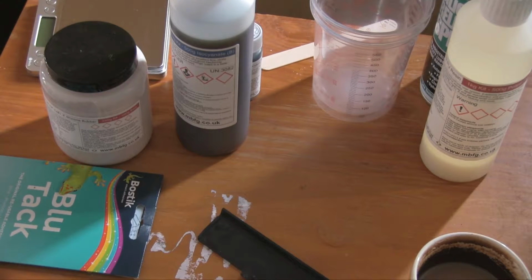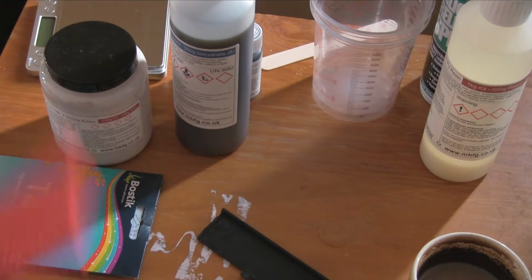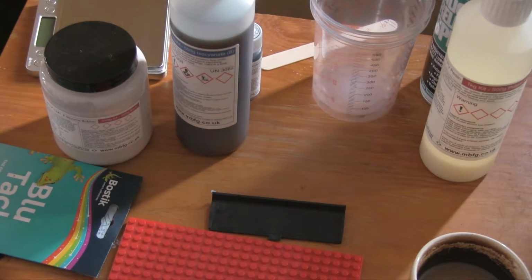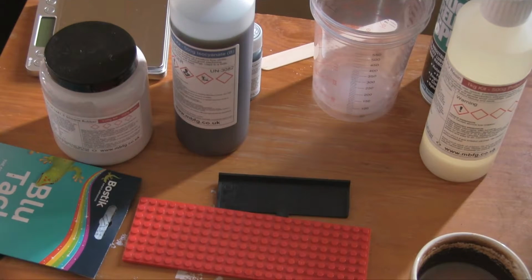And we will, of course, make our own using, well, Lego, obviously, because it's Lego. Now, Lego, as I found on previous attempts to use Lego for molds, is not actually waterproof. So even though it's obviously engineered to very high tolerances, they're not quite high enough, and this will start leaking through over time. So we will make the main frame using Lego, and then we will put cling film on the inside to add a watertight seal to it, and that should do fine.